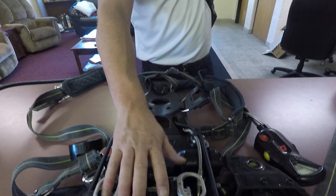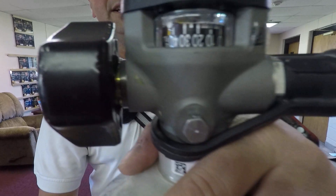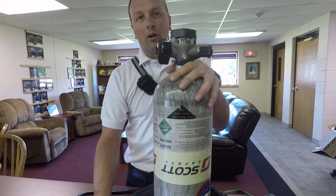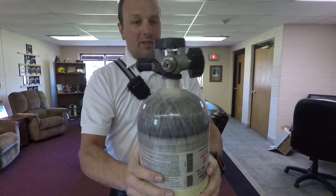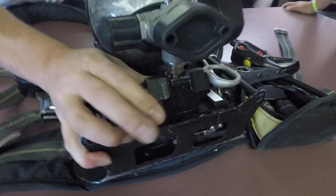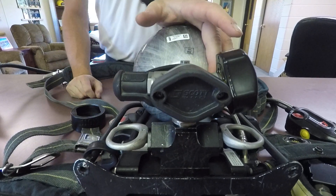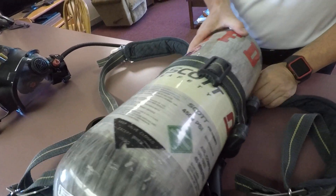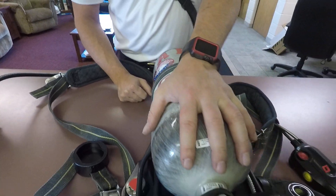Here we're going to install a bottle onto the pack. This is a 45-minute bottle. There's an air indicator on each side — it should be within 10% of full. So if it's 4,500 PSI, you could be 400 to 450 pounds less and still be considered full. The bottle slips in either through the top or the bottom. It rotates, so if it won't go in, pull it back until it clicks to line it up. The buckle cinches it up — it's supposed to be a little loose, so never tighten it until it's super tight.